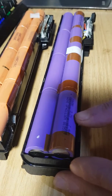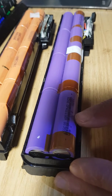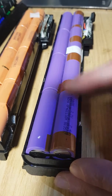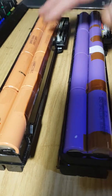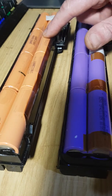Again, you can see they're 3.7 volt by 7.4 watt hours. There is the formula, you can calculate that out and divide the voltage and so on and so forth to give you the milliamp hours or the current that these batteries can deliver, which is not actually that much. On the other hand, these ones from HP are considerably higher energy cells.